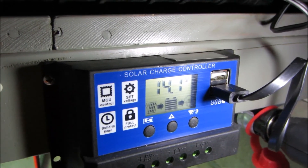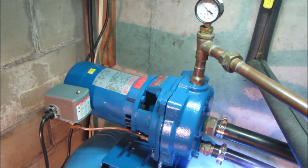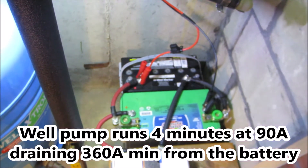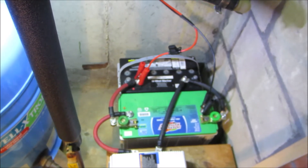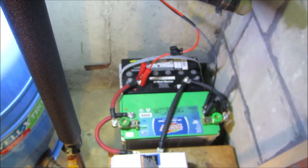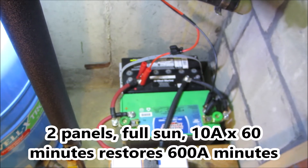I can run my pump all day off-grid on a sunny day like today. When the pump is running — this pump right here — we draw about 90 amps out of the battery bank. The pump runs for about four minutes. Four minutes at 90 amps equals 360 amp-minutes drained from the battery for one four-minute pump run. As long as the sun is out, we try to put that back. With bright sunlight, two panels each putting out about 5 amps equals 10 amps being put back in constantly — so 30 minutes gives 300 amp-minutes, 60 minutes gives 600 amp-minutes, and we only took 360 out.